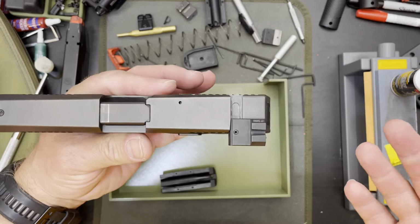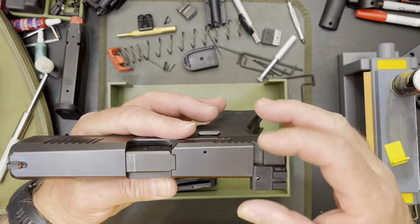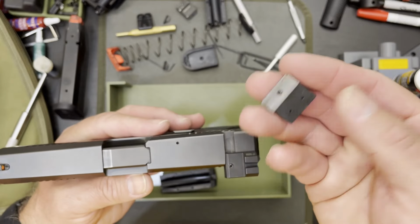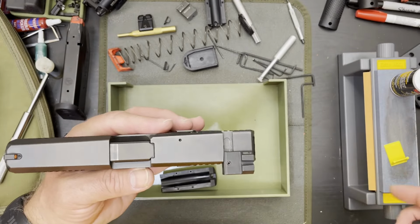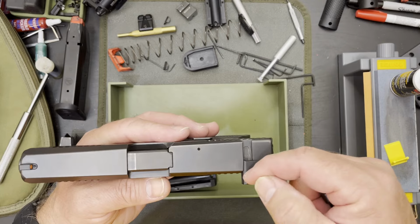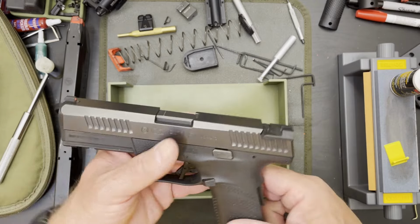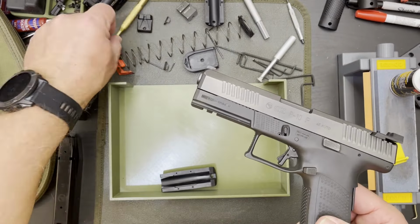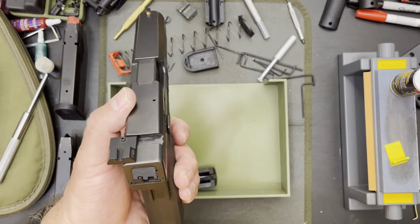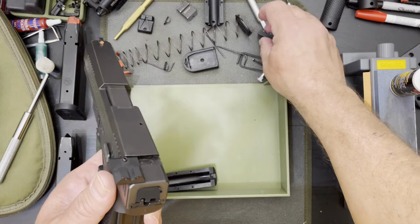When I go to put a rear sight on a P10 slide, I like the sight to glide in just past the set screw. Like I need this to be over another couple millimeters. And typically, most sights that I put on a P10 have to be fit. I do that by using my knife sharpener, the coarse stone initially, to try and pull enough material off here that I can slide this thing on enough to clear the set screw, right? Once it gets that far, then I'll tap it in with a brass punch and get it to what I try to identify as mechanical center, right? From there, I'll take it to the range, do some sighting if it's not the night before a match. And if it's good, I'll Loctite it in position. If it's not, I'll adjust it at the range.